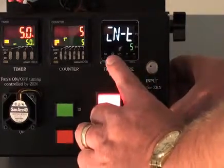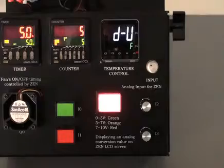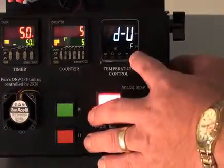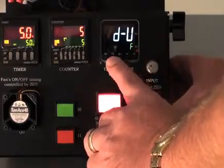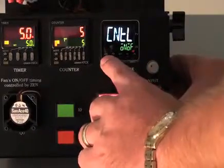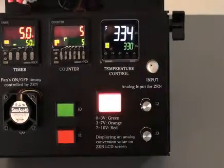By using the level key, also known as the racetrack key, we can press that to get to the section of setting our degrees Fahrenheit or degrees C. We'll set it for degrees Fahrenheit. You can continue using the level key to set other functions, but those should be well set. We'll go back to operation mode by pressing and holding the mode key for three seconds.